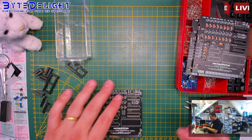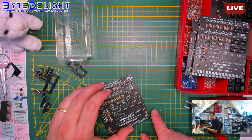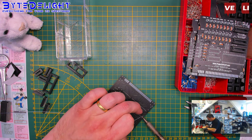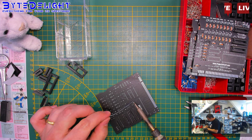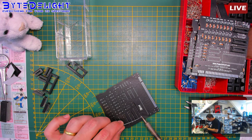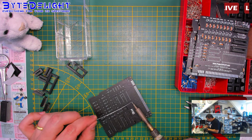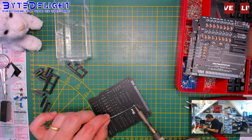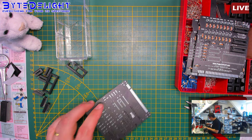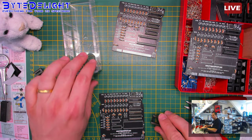Not now. Okay, and because the 32 socket is just a bit to the right, I'm doing that after the 20 pin sockets. So only two on the end. So, I now can leave it this way and I can do a meep meep thing again. And done. Oh, solder bridge, solder blob. And this one. Yep. So doing it this way doesn't take too much time.